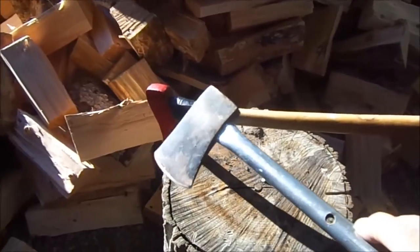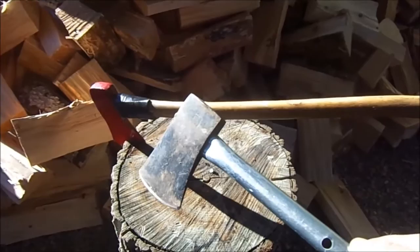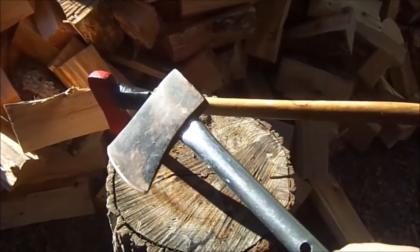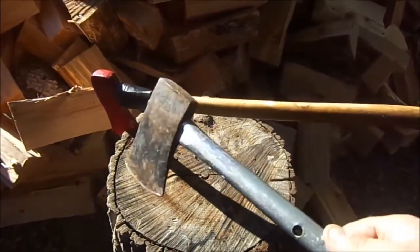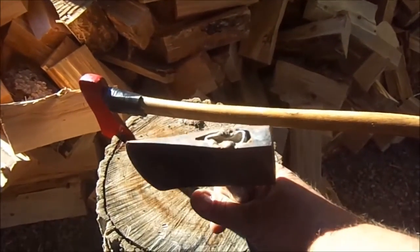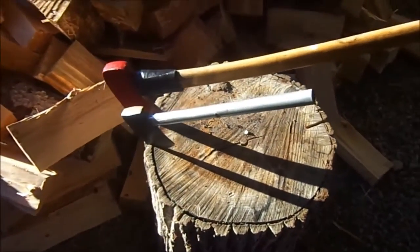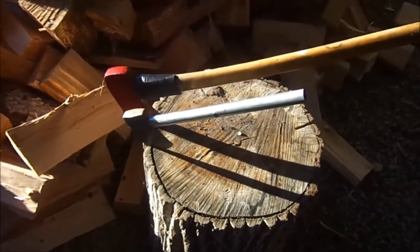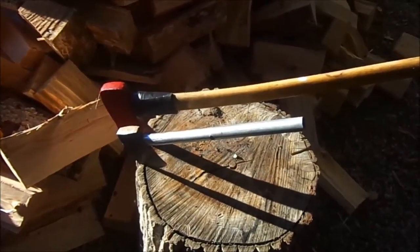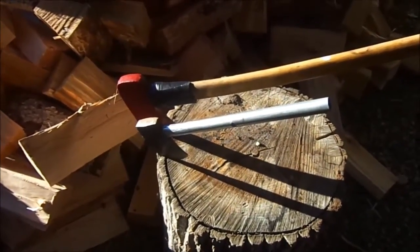This little hatchet — I come across these heads all the time. You get them at yard sales for a buck a head. And the handles are more expensive if you go out and buy a wooden handle. So I always just take a piece of steel pipe and pound it down and put it in there, then put a little weld on the top. That looks nasty but it works. You've got yourself a little hatchet that you can never break unless you abuse it. I've had that one for years — I use it to split the wood on my little stove and on my cookers.